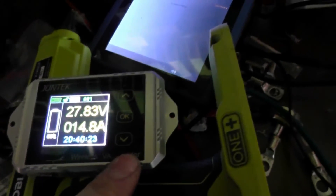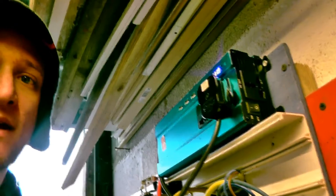I'm going to go check on the kettle — sounds like it's about to boil. I've got the cheapest, most Chinese 2.5-kilowatt inverter I could find for £30. It has USB outputs on it. It's actually a 110-volt inverter, so this one-kilowatt kettle at 110 volts is only pulling 250 watts — and it's just clicked off. There's another inverter on the way: an apparently five-kilowatt cheap square-wave digital sine wave inverter, also £30. I'm just going to use it for resistive loads like a bigger kettle until I decide what sort of inverter I want to put in place.